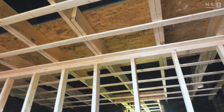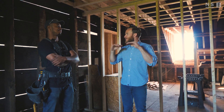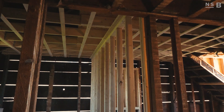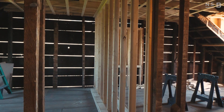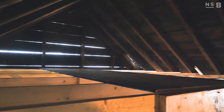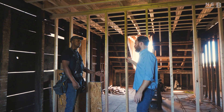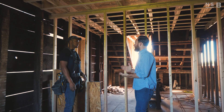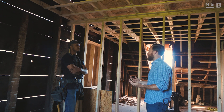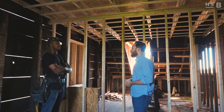With these rooms being so large up on the third floor, you don't want them to feel like attic rooms. If you look up, we have the framing here — they overlap and land on this wall, which becomes a bearing wall. Previously it wasn't a bearing wall, and this wall actually landed on top of just floorboards with no support under it. We actually moved the wall about six inches so it's now landing on top of a floor joist. So now if we put storage up there — Christmas decorations, mechanicals, whatever — any added weight is pretty much secured and covered.